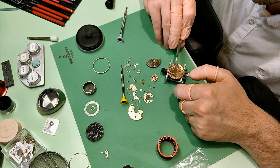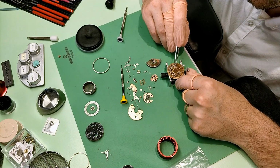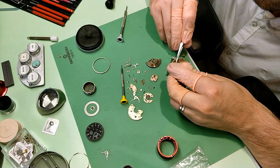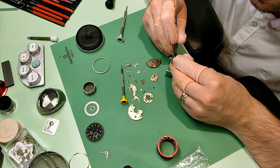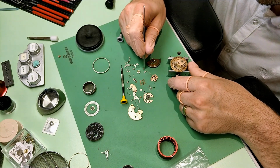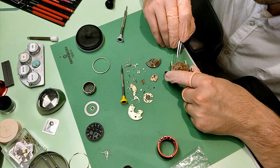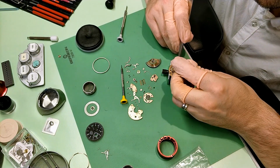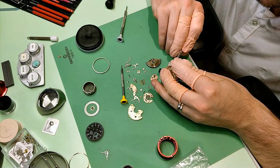Yes, it's really weird. Plus, titanium watches are really fragile. Weirdly, the thread on the case back is really easy to cross thread, so we have to put a coating of grease to protect the thread. But sometimes we find customers who try to open their watch and cross thread the case back.